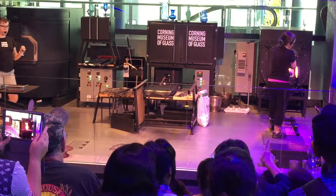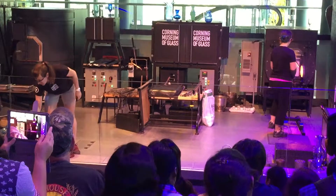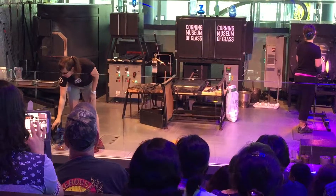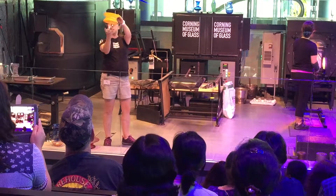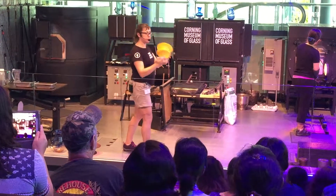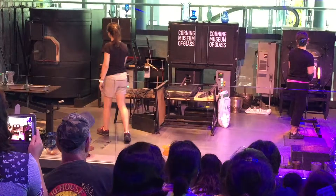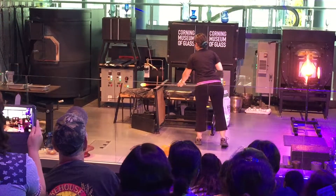If you've ever seen pieces of glass with a bespeckled appearance — little dots in the glass — that is exactly how that glassblower got the color in. You can see the orange is a little splotchy with windows of clear here and there. We can roll a couple of times to get a stronger color density, then go back into our reheating furnace and use the heat to melt that color back in.